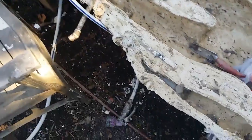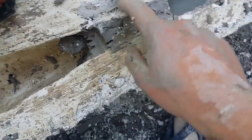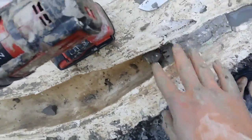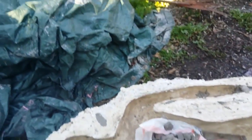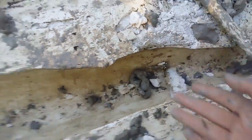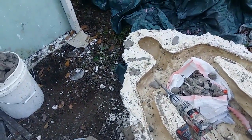We're trying to get the hands soaking to get the material out, and I've been pretty successful with the feet. As a note: if you end up with areas where the burlap is far away from the plaster, before you take the clay out you should try to fill that gap with plaster, so it doesn't cave in. In some areas we couldn't see that was the case, so we ended up with cave-ins — we'll be able to fix that in post on the mold.